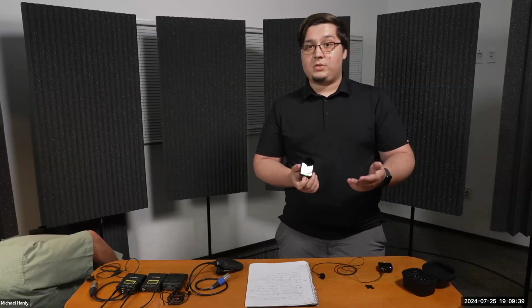Regarding the Wi-Fi aspect of it, what happens when there are a lot of people, maybe either on your set or in your vicinity, that are active on the Wi-Fi? What is the traffic? How does the traffic impact the system? Yeah, so what's going to happen is the system is going to start detecting that traffic is around, and it's going to try to correct itself. So one of the big problems is if it does try to correct itself, there's a couple millisecond delay or a kind of cutout between when it's doing a new pair, which is going to result in a full-on dropout. So if you're in the middle of the take, that might be a problem for you. If it's happening in between breaths or in between speaking, you might get lucky. But when we're on a real pro set, you can't rely on that luck.